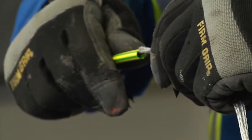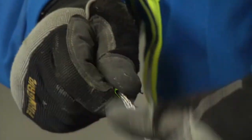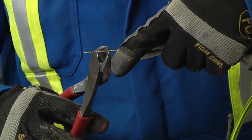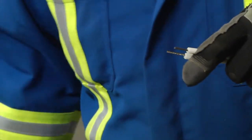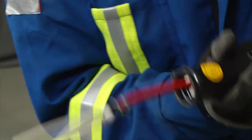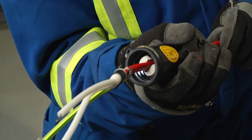Slip the green-yellow tube onto the braid. Trim the bus wires and braid, leaving half an inch (13 millimeters) protruding out. Pull the heating cable back into the stand so that one inch (25 millimeters) is exposed.